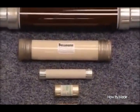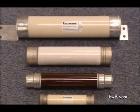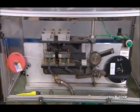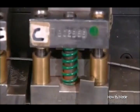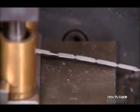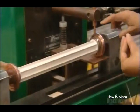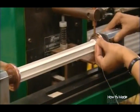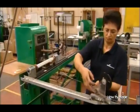Choosing the right fuse depends on your current needs. To make a high voltage fuse, this machine cuts notches in a long silver strip which will serve as its element. The notches will help control the way the fuse blows. They melt bits of soft metal onto the strip — the bits will be the points where the fuse blows. They weld one end of the silver element to the top of a ceramic core and then wind the element around it.